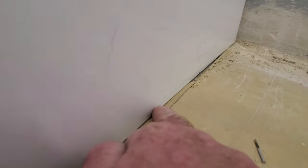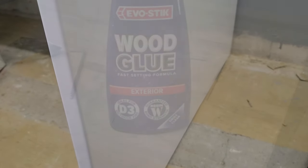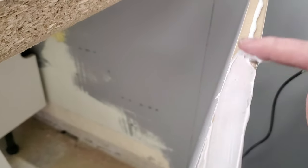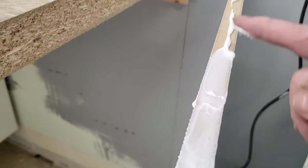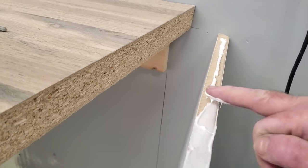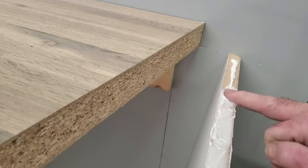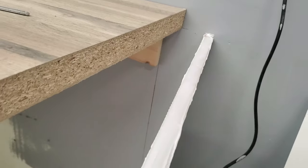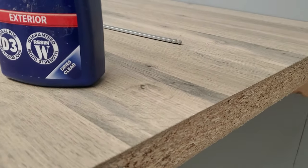From here back it's touching the floor - it was going on the floor about there. So if you're up on the floor now and the floor is a bit damp, it's not touching - structurally wise it ain't going anywhere once it's all screwed together, so that's okay. Once I've tiled the floor I'll probably cut another bit out of this and refit. I'll just put on a wee bit of waterproof glue - this is not to glue it, this is just to make sure water isn't getting in there. And it wipes off a lot easier.